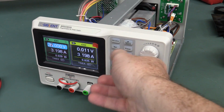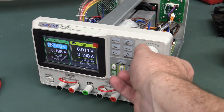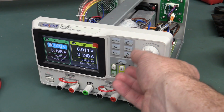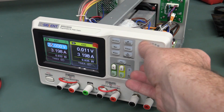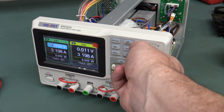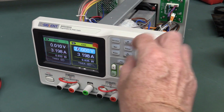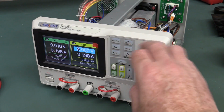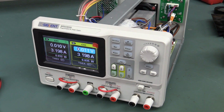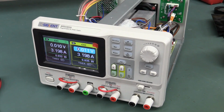And what I'm doing is I'm running both outputs here, shorting them out, and I ran them up to 32 volts. But once again, I still don't know, without actually getting in there and probing around, where the actual voltage taps are, because usually you'd put it at the worst possible tap. So I could put it down to say 1 volt on both channels here, and then that might be near enough to worst case power dissipation, because it's got to drop almost the full transformer tap voltage down to our 1 volt output, and then we short the output. So yeah, let's give it a whirl.